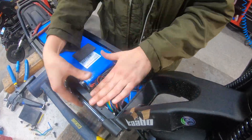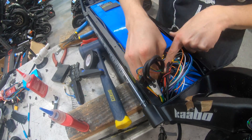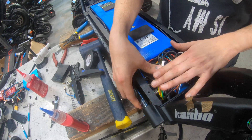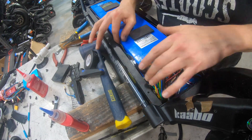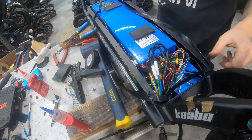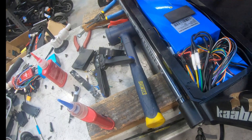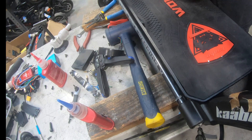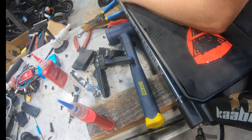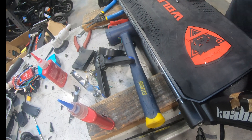Now at this point in the operation, we're ready to close the patient. We need to ensure that all the cables are in their correct location, that all the connectors are fully seated, and most importantly, all the wires are going to be out of the way so that they don't get pinched when we put the deck cover back on. Carefully ensure that the gasket is lined up with all the holes on the deck, lay the deck cover into position, take one last peek to ensure that no wires are going to get pinched, and then close it down.